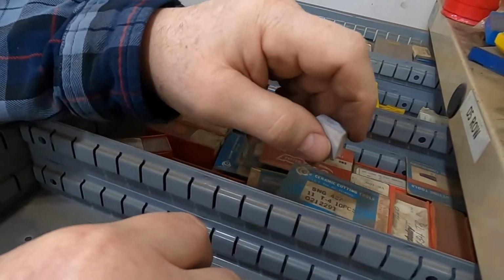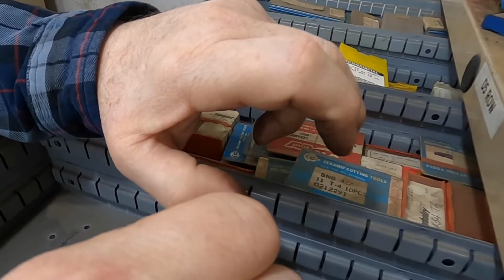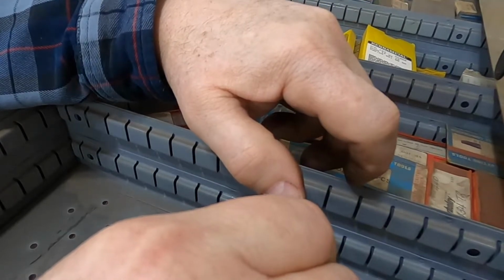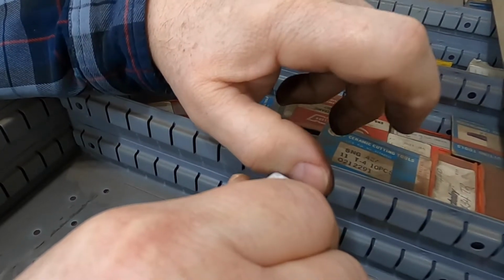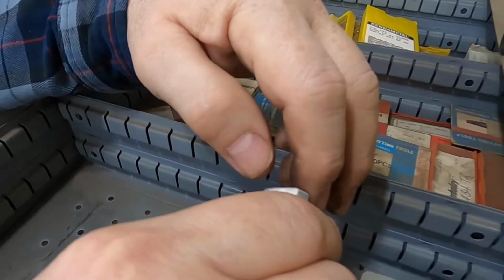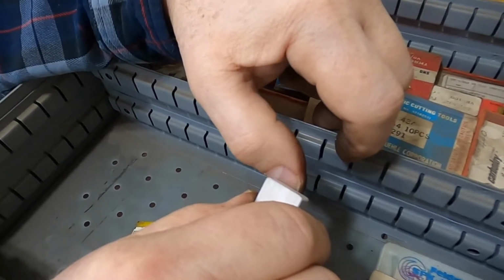And ceramic tends to be brittle. Ceramic is wonderful. It likes pretty low forward speed in your cutting, but it really likes lots of speed, actual surface feet of material coming past. And it does not like coolant at all. If you put coolant on it, it will explode, because you're running it fast and getting enough heat across here. The thermal change from throwing your coolant on it will cause it to just break up. It'll just blow apart. So you use this dry. It doesn't normally like intermittent cuts, but some of the grades of ceramic do to a certain extent.